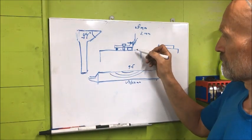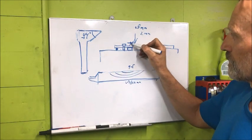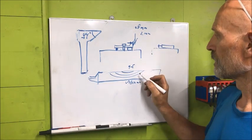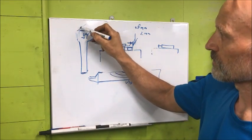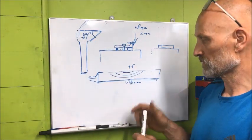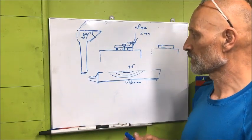So it might have been that it bowed a little bit here, and this other side then became just the opposite. It sprang a little bit up again, maybe. But I also saw that the rough casting in the lengthwise direction was also a little bowed. So anyway, it's perfectly within a reasonable amount of scraping. So I was very happy with the result.